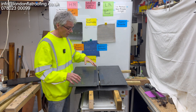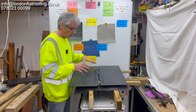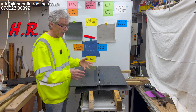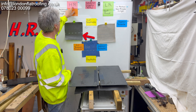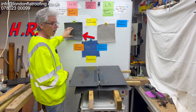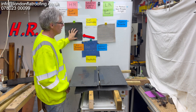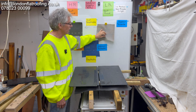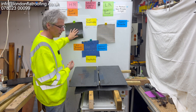Some slates — like these particular artificial ones — are air closed; they don't let air through. So depending on what you're going to do underneath them, it depends on whether you should be using this, which is an HR — a high resistance vapor closed product — so it doesn't let air through and it doesn't let vapor through. I see this misused a lot of the time, so I'm going to explain why it's misused and where and why you would use it.